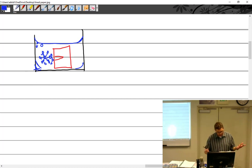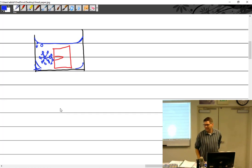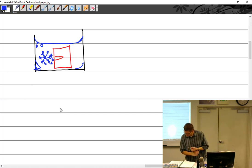We discussed leaving the part submerged in a tank, which we just did, versus letting it drain. All right. I think I can skip some of this. Slow drying. Why do you want it to be slow drying? What if you let it dry on the part? Now, I've worked with technicians who started NDT stuff, and it's time to go, and they're like, well, you're in your dwell time, you're draining. You'll be fine till tomorrow. No, I won't. Yeah, it dries on the part, and then now you've got this stuff that's dried on the part, and so you've got to rinse it, and then you get dried penetrant in the crack, which is going to hinder your inspections. So you don't let it dry on there. That's really a bad thing.